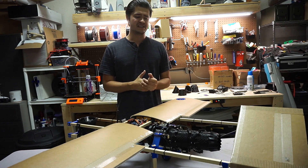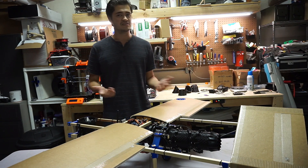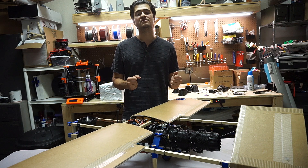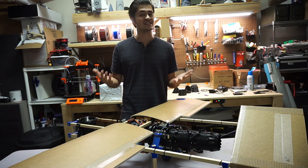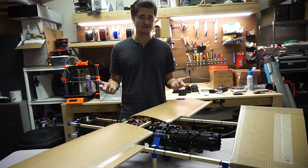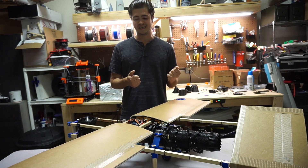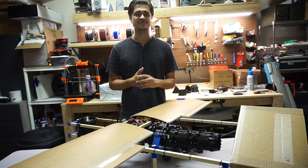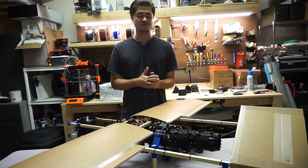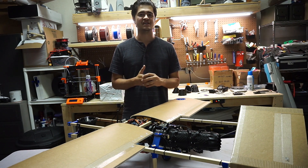The next thing I'll be working on is making use of the travel range beyond 90 degrees. You saw in the previous flying videos that the 3BSM can move a little bit to vector the thrust for forward motion when hovering, to keep the body from having to tilt. I need to extend that to backward motion as well so we don't have to tilt backward to travel backward while hovering. That's going to require some changes to ArduPilot — a little harder than just changing the duct control code since it's intermingled with a lot of core flight controls — but I'm pretty optimistic we'll figure that out.